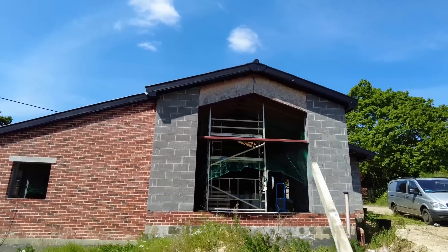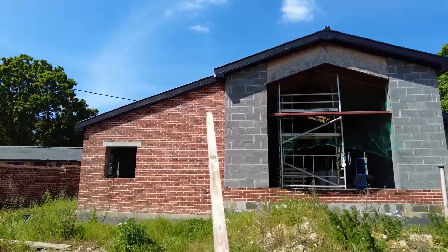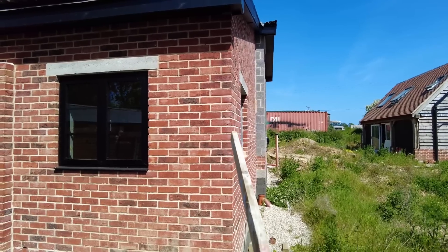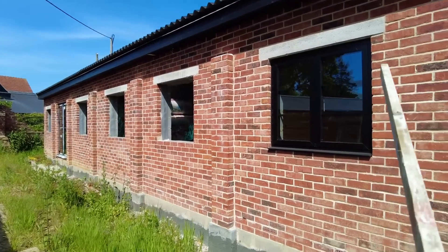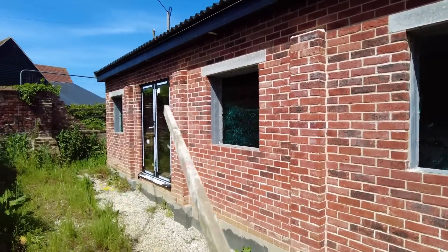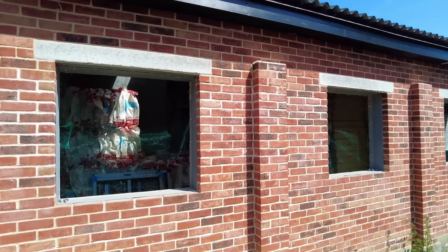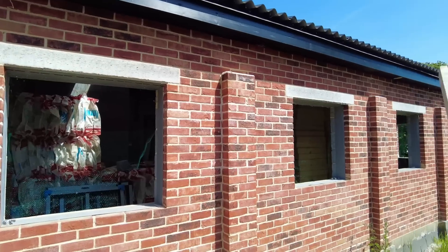My south side is fine — it's a short run, tied into this section. For clay brickwork you need expansion after every 10 to 12 metres. This side is slightly stepped back from the main area — I'll call it the barn because it used to be one. That run is about 15.5 metres but I've got no expansion gaps in it. When I originally asked the bricklayers, they said the windows or French doors count as an expansion gap, but I don't think they do. I really should have had one somewhere on this wall.